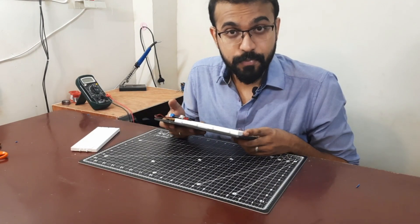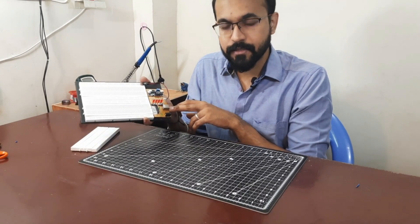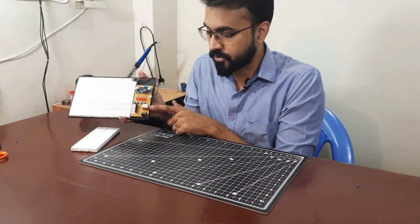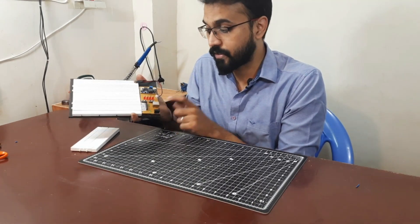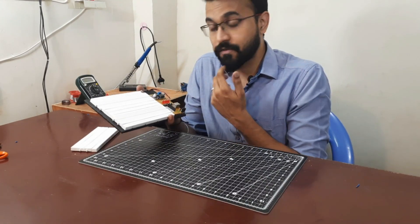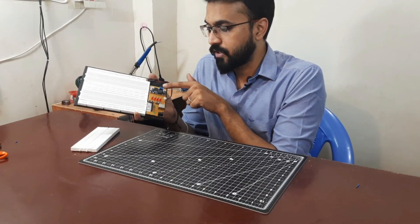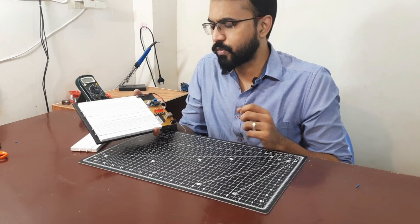To avoid the power supply problem, we already have a few regulator circuits and a USB power supply circuit here. Whenever you want five volts, you can connect a USB cable from a power bank, a laptop, or a USB power supply to this board — it uses the same cable as an Arduino Uno — and you'll get five volts output which can be directly connected to the board. Similarly, whenever you want a variable power supply, you can connect a 12 volt power supply here and change the voltage using this buck converter, which has a preset by turning which you can get a voltage between 1.3 volts to 12 volts.